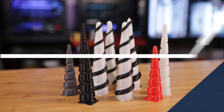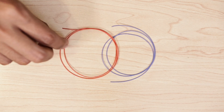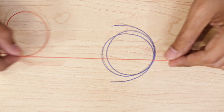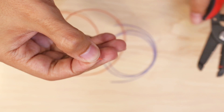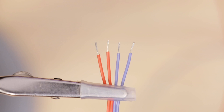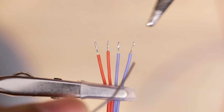Now to make it glow, let's start by preparing our wires. The silicone-coated stranded wire is really great for this project because it's flexible and it doesn't break easily. We'll use some wire strippers to remove a bit of insulation, basically exposing the wires. I recommend tinning the wires with a bit of solder, which will make connecting them to the LED much easier.